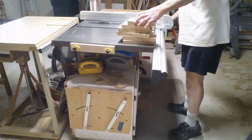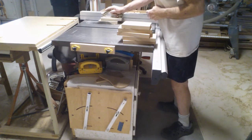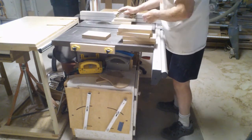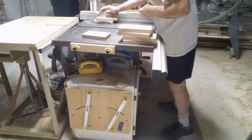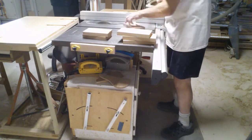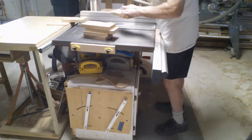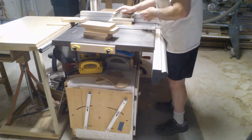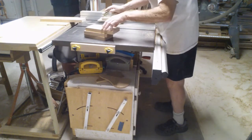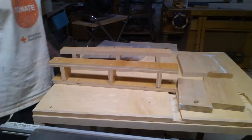What I'm doing now is cutting down my boards to size so I can glue them together. This is for my bottom — the base ring that my segments will sit on top of. These were cut all the same size — six inches, seven inches, whatever it is. Now I'm just running an edge on them, then I'll flip them over and do the other edge. That way I know they'll glue together good. I seem to have a pretty good saw blade and a nice straight cut — I don't need a jointer.